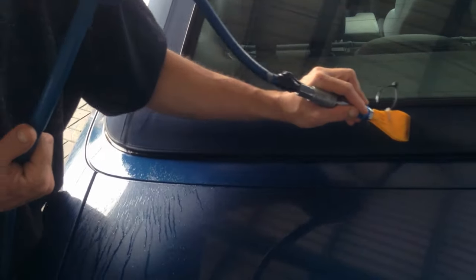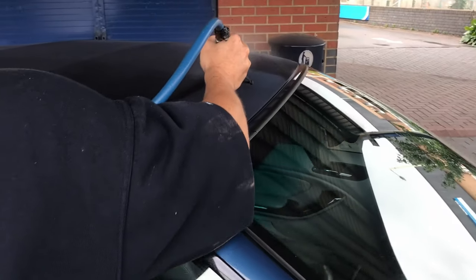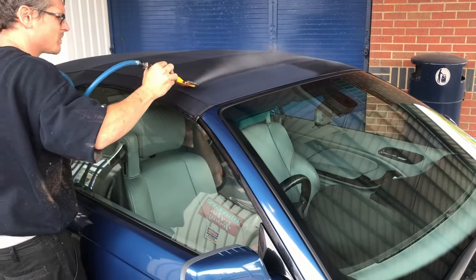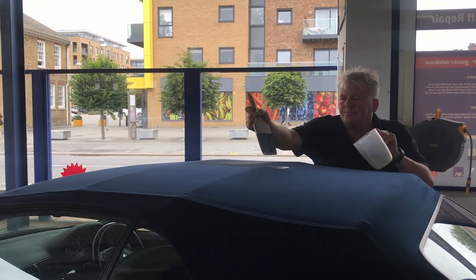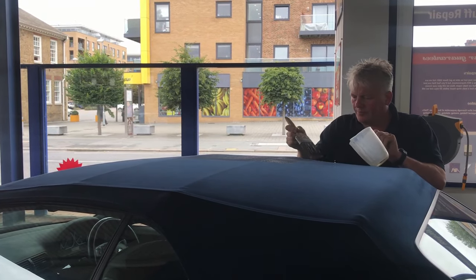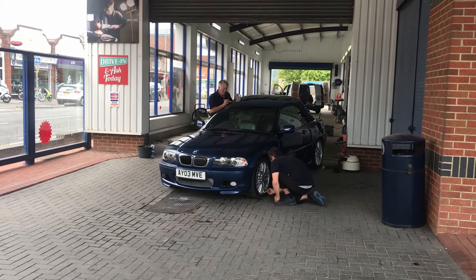Then, once it's all washed off and we know we've just got what's left, we're going to use a power brush. We're going to power brush out all the grit and the dirt, rather like replicating what a washing machine would do. Wouldn't it be lovely to take it off and put it straight in a washing machine, get it out clean and put it back on? You can't do that of course, so we're going to be brushing it with a machine a couple of times until we know all of the dirt's out. The secret behind getting a great clean roof is the cleaning bit.